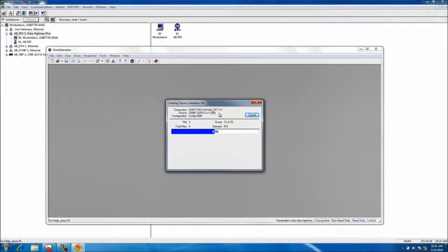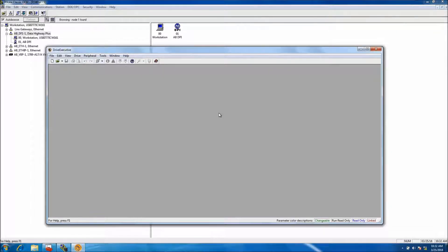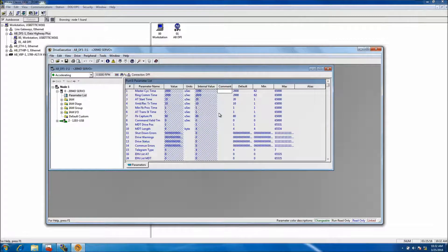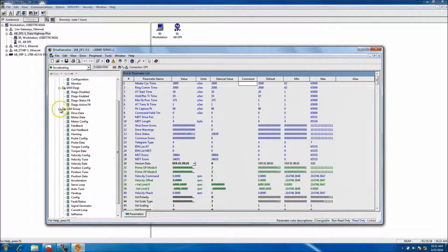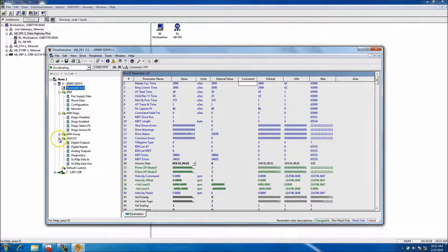So this does work — I'm using DriveTools and I've heard many people say you can't do this. It's kind of a 50/50 debate, but I've never seen anyone actually do it live outside of a Rockwell class. Here it is, live on YouTube. You can see I'm connected to the power supply module — it shows the power supply information, homing, grouping, I/O, and down here it also shows my scan port, my 1203 USB.